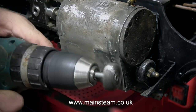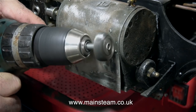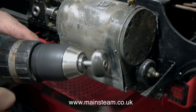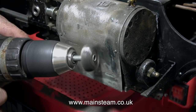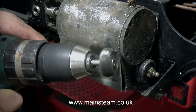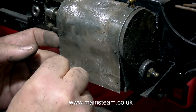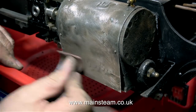It's a two-pack epoxy putty, but one half of the epoxy mix has got some ground steel in it. It really is good stuff to use. There are certain parts of the cladding where I cannot successfully get to with sandpaper, mainly near the rivets that hold the cladding to the cylinder. I don't want to change the shape of the rivets by sanding them down. It took about half an hour on this side to get rid of the paint, but now it's more or less all gone.